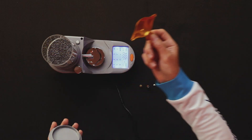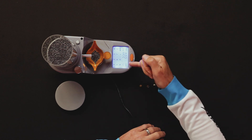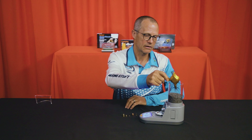We throw this one back for convenience — normally we'd pour it into our cartridge case as part of the loading process. The charge is stored in the system, so simply pressing the start button again gives the same powder charge: 22 grains dispensed in another 15 seconds or so. It runs nicely up to the charge and we get 22 grains of powder. If you're in a rush, as soon as you hear the beep you can throw your powder into your case and get going again.